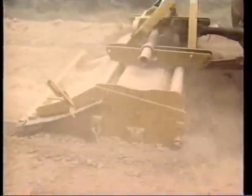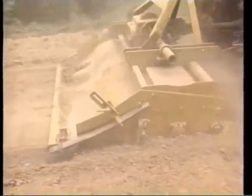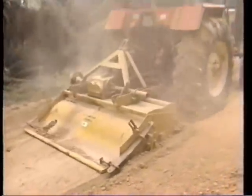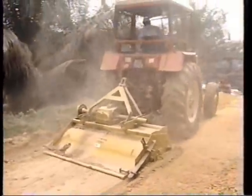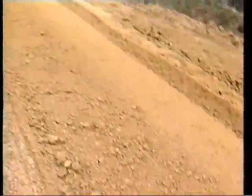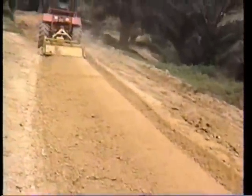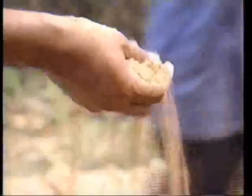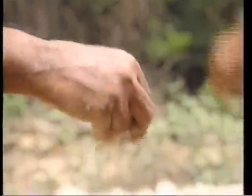Lower quality road-based material is often present at construction sites. Conventional methods require bringing in expensive coarse gravel or crusher run to supplement, with fines content less than 20%. Roads constructed with TeraZyme can use more than 20% existing soil fines and perform well, reducing cost and time for road construction.